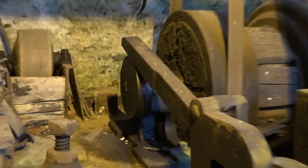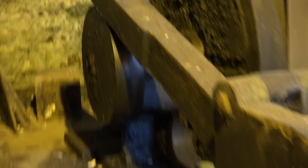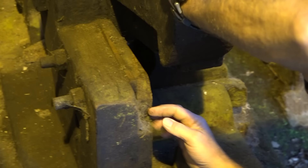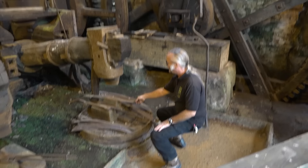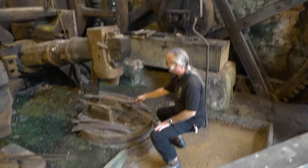This water-powered axle once turned, and these beautifully curving three-pointed cams, over which rode a wheel in a tipping beam, worked these vertical rods up and down, which powered these drums set into the ceiling. They were huge bellows, and these blew air along this pipe across the ceiling and down to a junction with two valves, which regulated airflow to the 1,000-degree furnace on the right and the 900-degree one on the left. A drawer-like hopper for coke. At the end of the main drive shaft is an eccentric cam which works a bar above it up and down, which works a gigantic pair of cast iron snippers. The bottom hard steel blade is in place with a wooden wedge next to it, but the upper blade is missing. In one turn of the drive shaft, this would snip through a thick billet of steel. The hammer operator made about 84 scythe blades a day. He sat on a seat suspended on a single iron rod, which gave him great freedom of movement. Beneath was a shallow trough filled with sand or water — if he accidentally dropped a very hot bit of metal, this would catch it gently and safely.